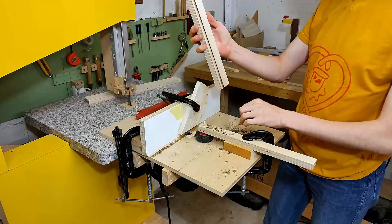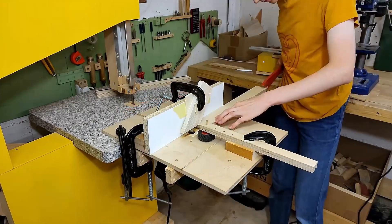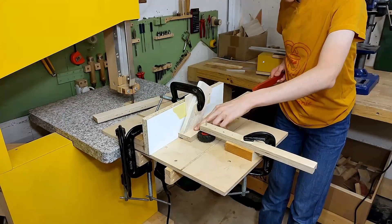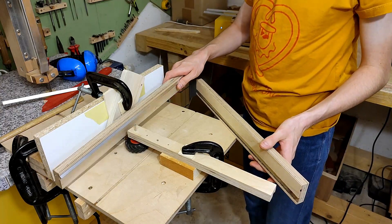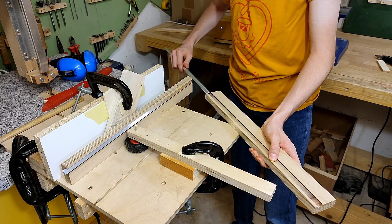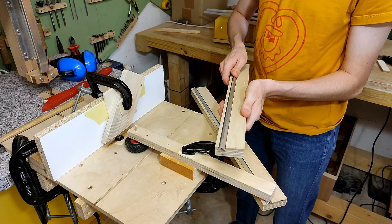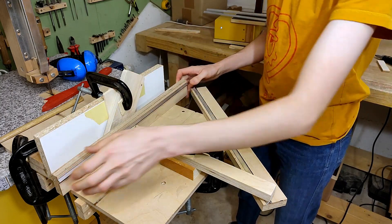For the other side, I adjusted the router to cut the slot just a bit too tight, then I test it, adjust the fence, shave off a bit more, test the fit, re-cut it again, and so on until I get just the right fit. I followed up with a little bit of scraping along the edge with a carving knife, which had more impact than I realized — this one's now almost too loose, but the other one's exactly perfect. What we're looking for is a snug fit: you can push it in with one hand, but it won't fall out on its own. This one's perfect; the other one is just a little bit too loose — you can push it with one finger, which is kind of sad, but it's done now.